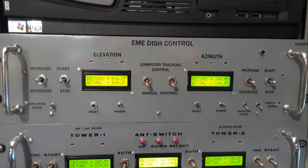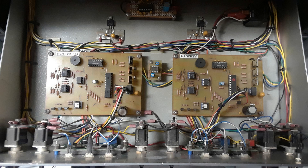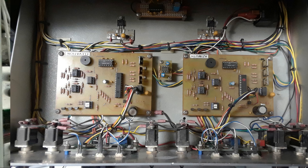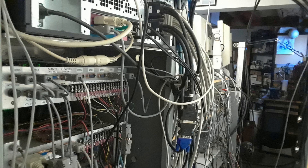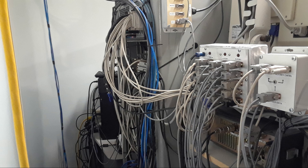This shows the next main part of the dish control — the EME dish shelf, or the PIC shelf. I call it that because I'm a heavy user of PIC microcontrollers. From this panel I can move the dish manually. It's a little more cumbersome than using the Visual Basic screen but it's another way of doing it. It's from this panel that the inside control talks to the outside electrical enclosure where there are more PIC microcontrollers. There's a lot of cabling — multiple serial cables coming and going — most of which is for controlling and monitoring the amplifiers.